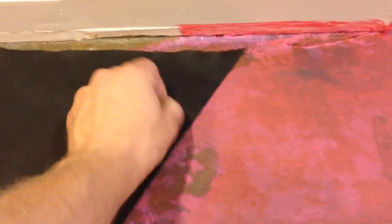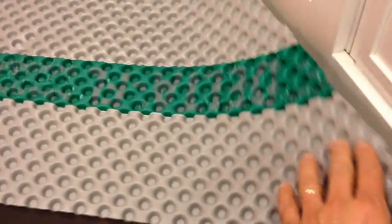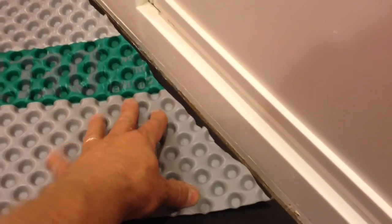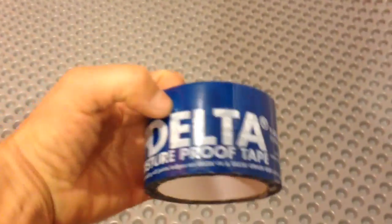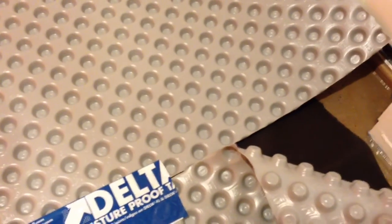First off, there's the pink stuff. That's Red Guard waterproofing. That's just to seal the concrete. And that is landscaping fabric, so there isn't any clicking noises when you walk. And then you have the Delta FL, cut about a 1/4 inch from the wall. It's not for expansion or anything. It's just for foam. It's gonna get all filled with foam after the flooring is installed on top.